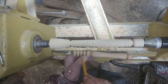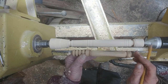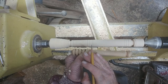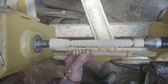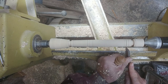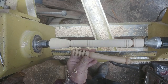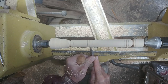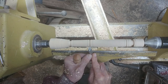One thing I want to do is not mess with the barrel right now — I do that the last part. So I've got my high spots and low spots marked. I pick up my skew and go in here to highlight my low spots so I don't lose track of them. This is the skew, and I know that's the low spot right there. So I just come in and carve out a V, just like that. I come over to my other low spot, check my reference, come up here and make a V just like this. It's a very simple process.